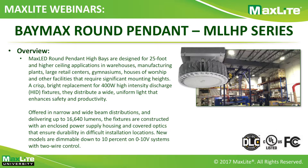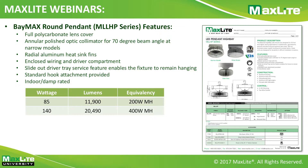In the round category, we also have the MLL HP series, which we've had for a couple of years. It's a small profile product, slightly larger than the HP Gen 2, but provides exceptional almost 140 lumens per watt. Available in two wattages — 85 and 140 watt — and DLC premium listed. A unique feature is the ability to add a reflector, narrowing the beam angle from 120 degrees down to about 70 degrees. It features radial aluminum fins — not the typical UFO design — a slider tray for easy wiring installation, and comes standard with a hook removable for pipe-mount installation.